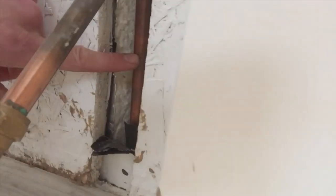In this particular case I had a piece of wood fall down onto this little loop that I've got where a radiator is supposed to be but I haven't installed it yet, and it bent those pipes. You can see those elbows there are bent. Luckily the whole thing didn't spring a leak, but what I'm going to do now is slice out the middles here, put a coupling unit in, put an elbow in, and replace that bit of the system. But first of all we've got to drain the system.